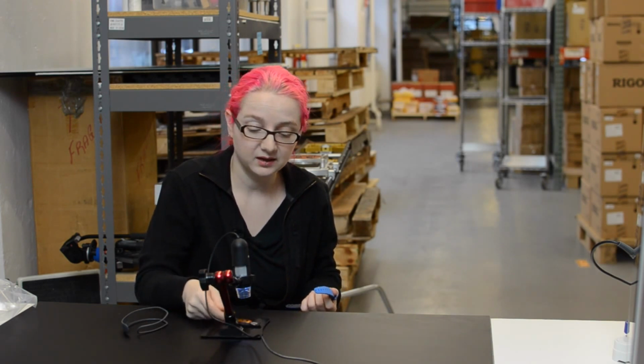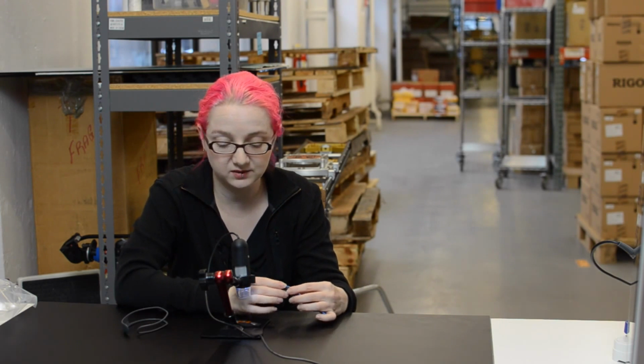It's not the cheapest design they could have gone with, but it's definitely a really good design. You can tell they didn't go for some really low cost chip with like 900 megahertz that requires a big antenna, maybe more battery. They went with a Nordic solution, kind of trusted, well-known chip, and it's very simple. And they probably make hundreds of thousands, if not millions of these a year, and they seem to be working out okay. So Nordic, you win this one. And that's our teardown of the Magic Band.